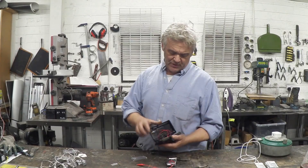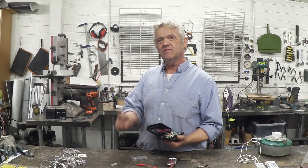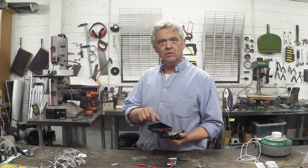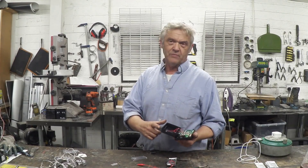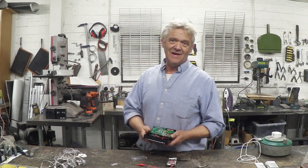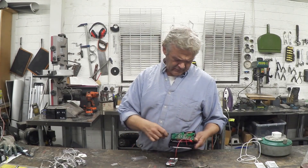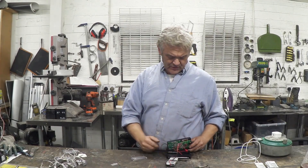Something that's a bit more sensitive, like this radio — if I take the radio apart, there is my battery holder right there. Again, it's in series, so it's meant to run on 3 volts. But normally these have protection circuits all over them, same as your phone. Your phone is being fed with 3.85 volts, but the phone logic needs anywhere between 3.3 volts and 5 volts, so there's an awful lot of regulation to make sure the voltage on the circuit is controlled. Whereas the input voltage from a battery is all over the place, so an awful lot of voltage spread can be put on the battery. So one phone battery is normally going to run just about anything that runs off two double AAs. You just identify the positive and the negative and we can turn this radio on and play it.